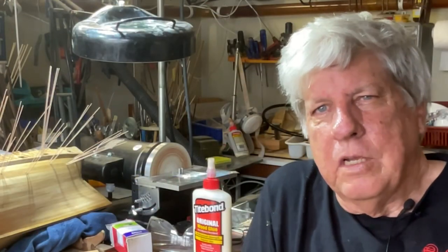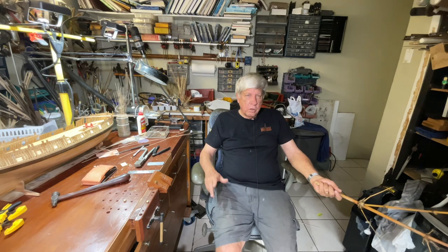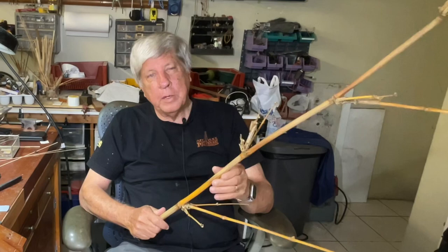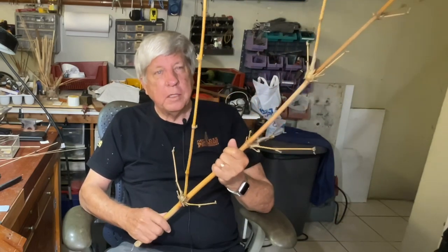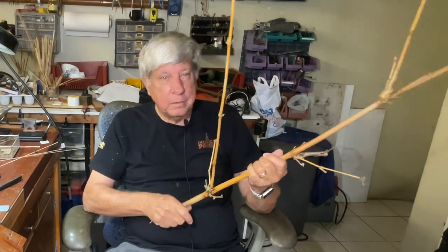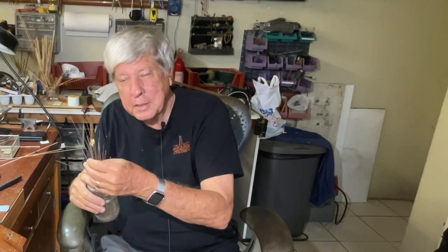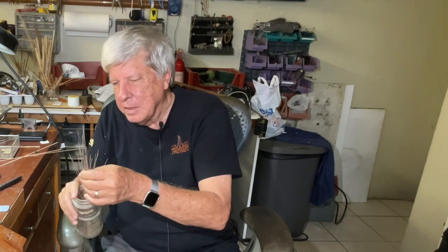We're now going to go back to the more traditional way of making tree nails using draw plates. The first thing you need to do is make up some stock. I live in the Caribbean, and the recommendation in the book says bamboo makes the best tree nails. So I got lots of bamboo, all different types — big and small. But I have to tell you, they're a bit of a disaster. This was the best I could do with bamboo tree nails and I'm not very happy with them. I really prefer to use hardwood. The best way is to get absolutely straight grain, preferably quarter-sawn wood, and make your pieces from that.